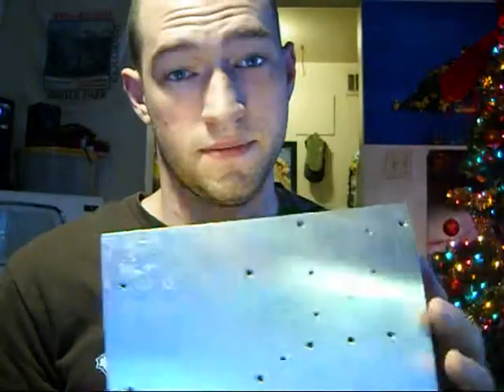This, you might recognize, is the small aluminum heat sink I was going to use for the bottom of my assembly. I decided that I was initially using two Peltier units on this, but now I'm going to use probably something closer to four, maybe even six Peltier units this time. So I went from something this size to something this size. This is going to be the aluminum heat sink I'm putting on the bottom. I'm not going to use the entire thing — it weighs about eight or nine pounds. I'm going to take a hacksaw to it and cut the exact size I need. That's some pretty thick metal, but a hacksaw is my only option right now.